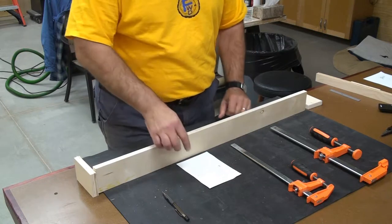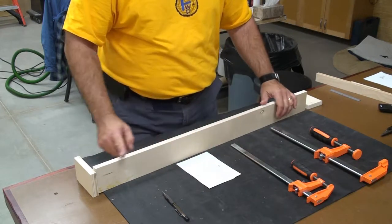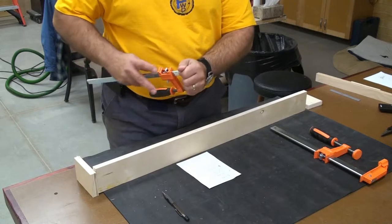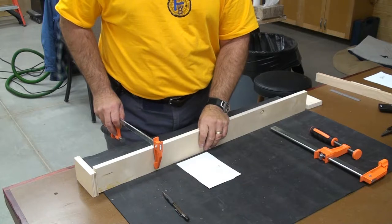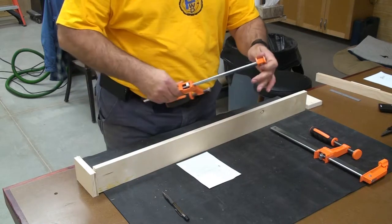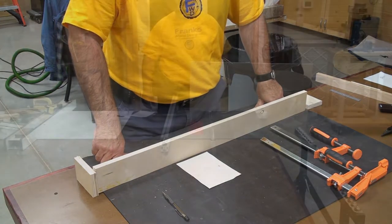On that drawing, you'll see a bunch of little notches. What I'm going to end up doing is cutting into this shelf the distance of that bar clamp rod, so that when it goes into the shelf, it'll have a slot to sit inside of, so that these things don't move all over the place like that. Okay, so the first thing we have to do now is start getting the plywood and start cutting it up, and we'll go from there.